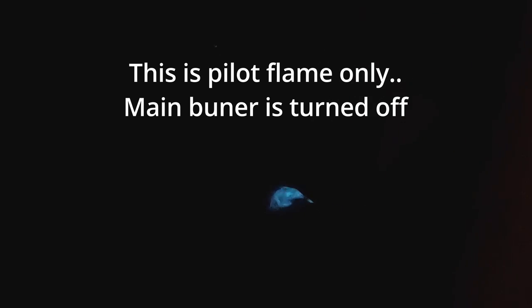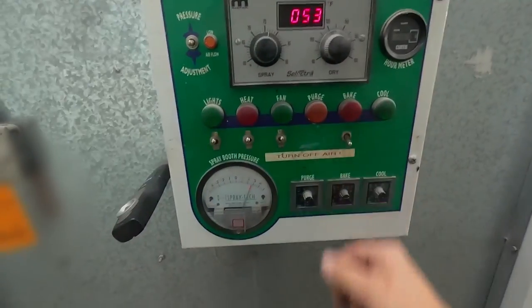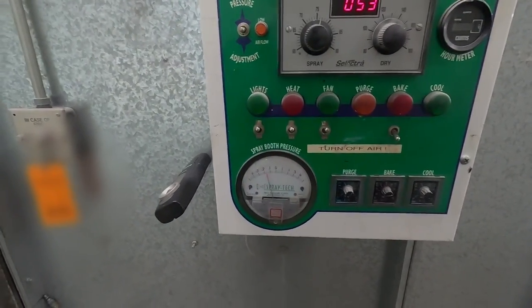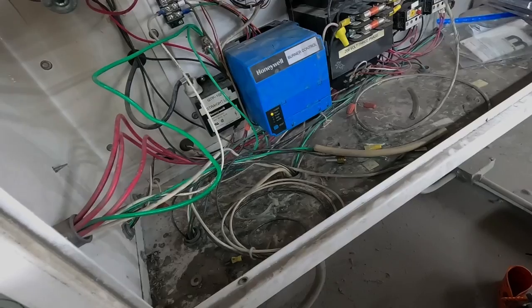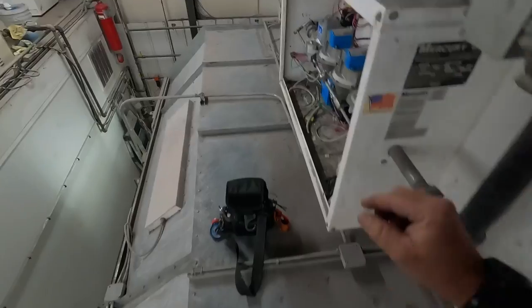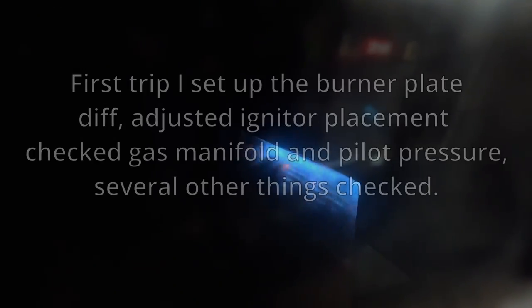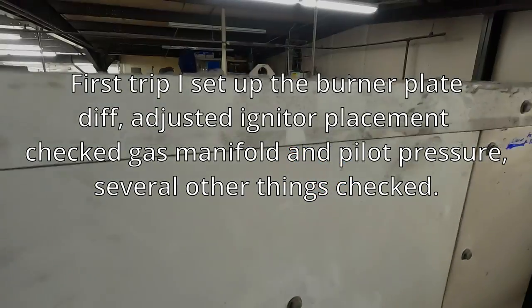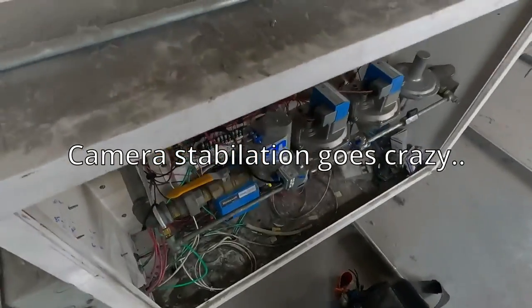Now it's got that front display on. It's lighting. So in the bake position it's kind of closed down. Let's turn bake off. See how the pressure started to drop. Let's go ahead and hit reset, let it start over again. This is in the traditional mode that it would start in — boom, instantly. I'm going to hit reset and run over to the other side, see if I can see what that does. Yeah, it was already lit up. Let's go ahead and turn it on — let her eat. See how she does. So there you go — you can see the main burner. I may have just finally gotten it. Oh my goodness. That stupid plate. That little dinky plate thing. It's still kicking on every time — perfect. Guys, I think we finally got it.